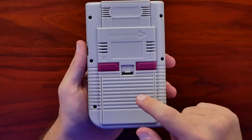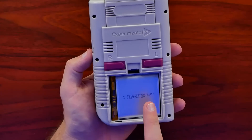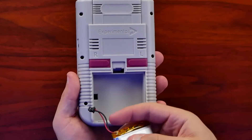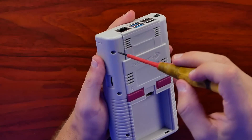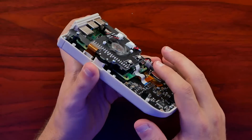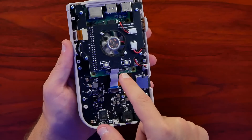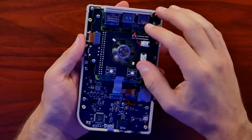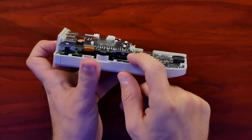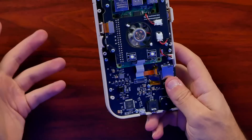I'm not a big fan of the back buttons — they're hard to find and don't always register because you have to press at exactly the right spot; too far over and you won't get a solid click. Under the battery door, which pops off, we have the battery — included with the kit but installed separately. It's a 4500mAh at 3.7 volts, a plug-in battery, clearly marked and only plugs in one way, very easy to install. There are six screws to get the back panel off. Inside we can see a couple of customized boards: one just above the Raspberry Pi 4, the Pi 4 itself is the green board, and above that we have active cooling with a fan. Several cables plug in with no soldering involved — it all communicates through the header on the Raspberry Pi itself.